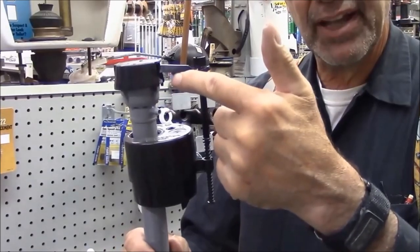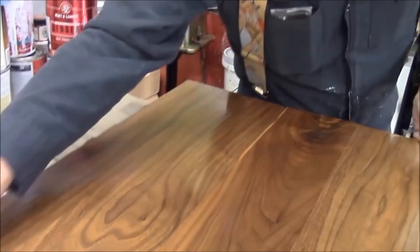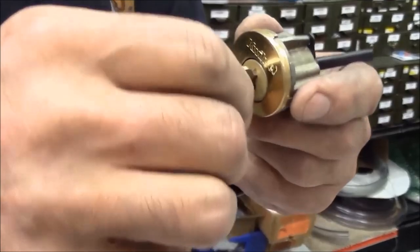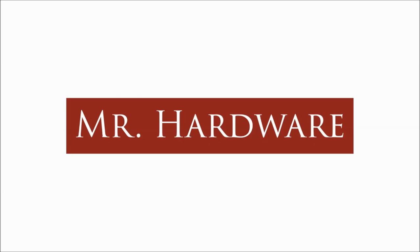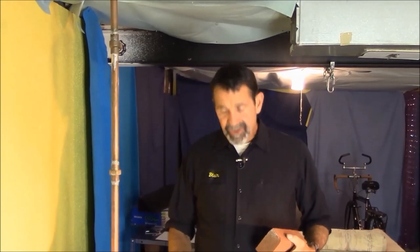Hi, I'm Blair Gilbert for MrHardware.com and Gilbert's Pro Hardware in St. Clair Shores. Here we're talking about sump pumps and running too often in an hour. This has happened to me personally at least four times — the sump pump is running every ten minutes. I've found that the sump pumps have been too deep or too low in a sump pit.